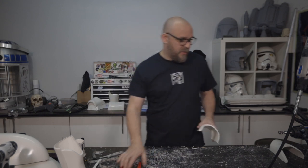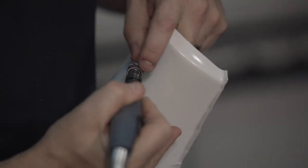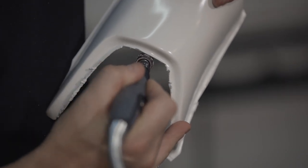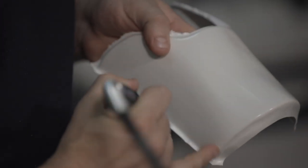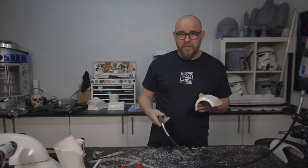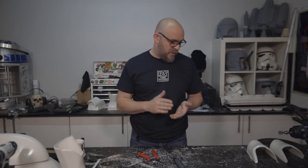That's quite important. Second point — when using the Dremel sanding bob, use the back area of the sanding bob, down here. What that achieves is you're able to correct yourself before the sanding bob comes clear of the work and drags up it, leaving big marks — you want to avoid that. Also, if you're not confident with the Dremel, turn the speed down. That's going to make life a lot easier. As you build confidence you can turn the speed up.